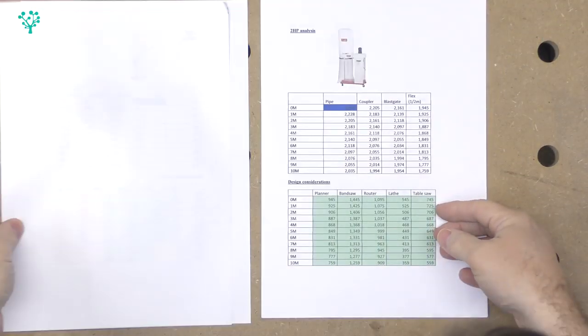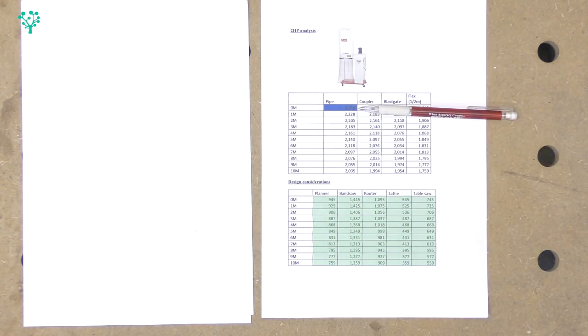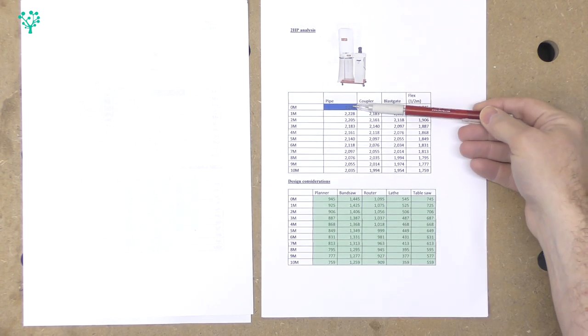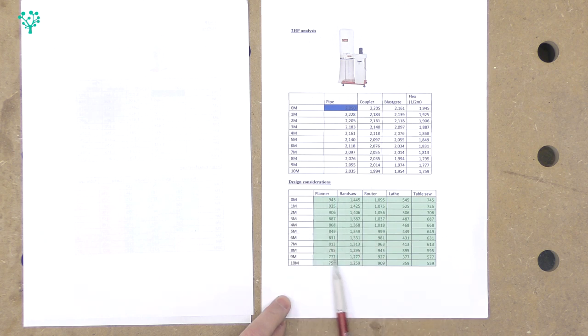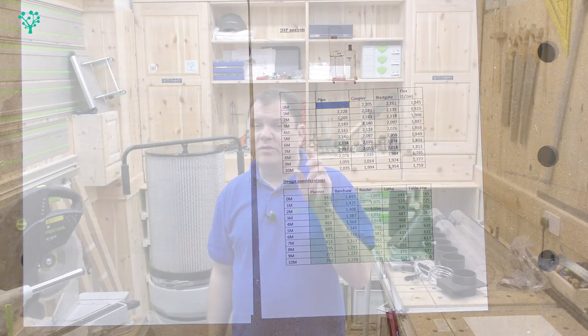That's knowledge I wish I'd had. The next one up is the 2HP — 2,250 m³/hr assuming we're using the 175mm pipe and not the 100mm pipe. And you can start to see this starts to give you usable figures — at 10 metres I'm still in the 2,000 m³/hr range. The 2HP is giving me good coverage throughout my workshop across all these devices. So the device I should have bought for this workshop is probably the 2HP. Physically it's not a lot bigger than the 1.5HP, but don't forget the pipe is bigger — 175mm — and to put a 175mm run in this workshop will be really quite hard to plan. I'd have more cost in the pipes and fittings, and above this there's a structure to hold the garage door which I'd have to remove and change in order to install that. So at some point you have a compromise.